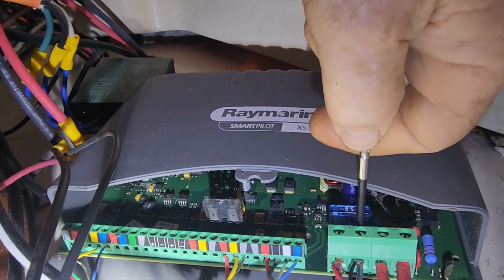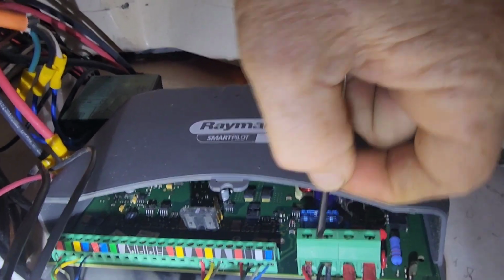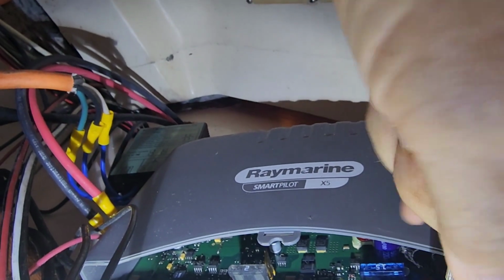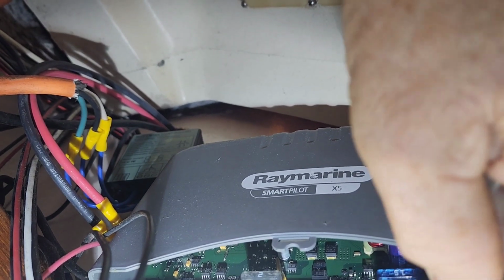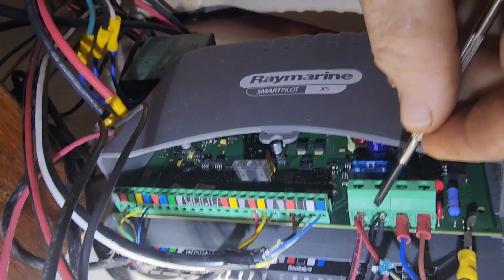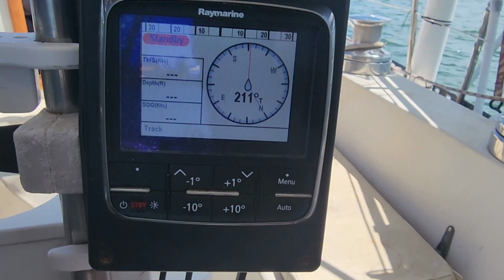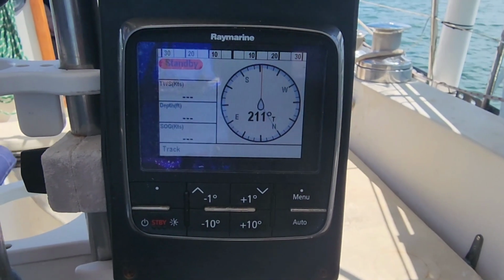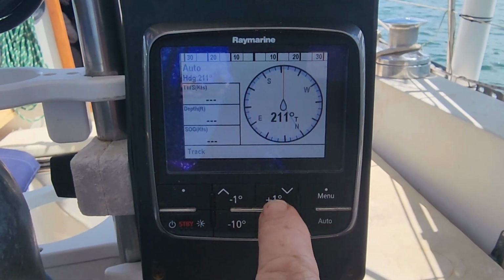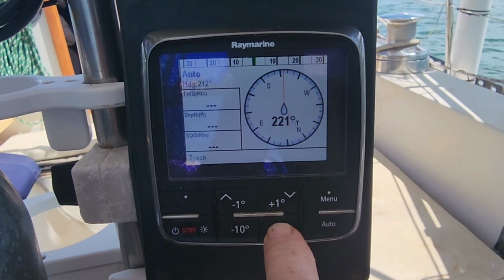Okay, going over all these connections with a screwdriver again, and I found this loose. This appears to be the ground wire. Look at that. See that? I'm not real impressed with that. So let me take this apart and reconnect that. See if right here, see if this will solve the problem. All right, we've tightened up that ground wire. Let's see what we got. I've got my meter hooked up. Let's give it a course correction.